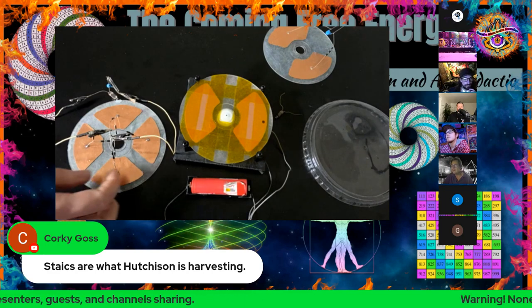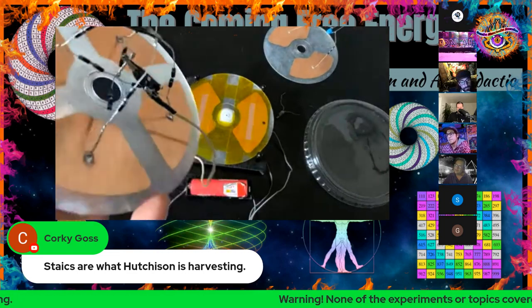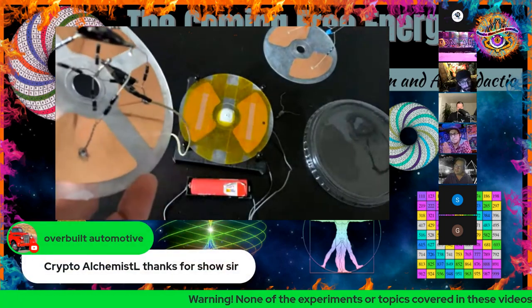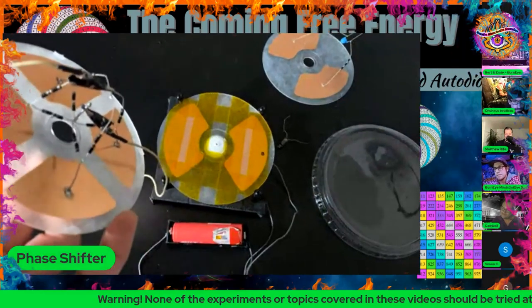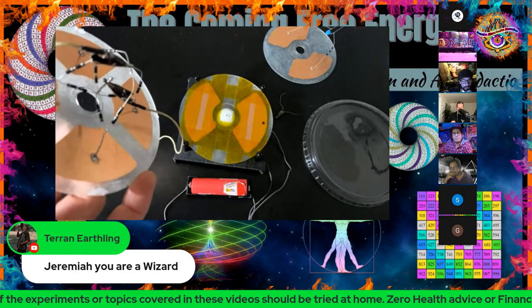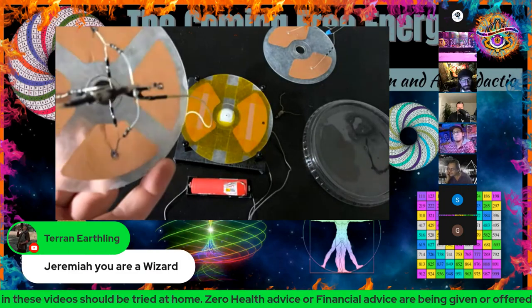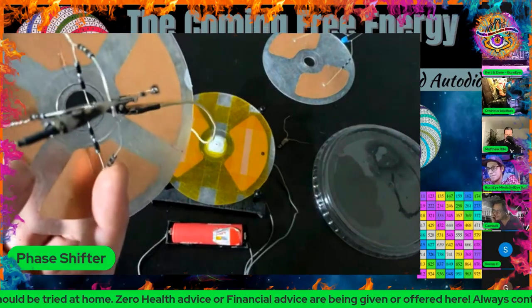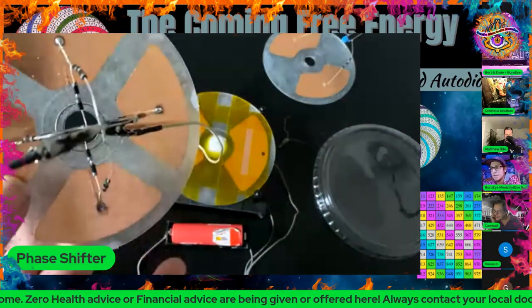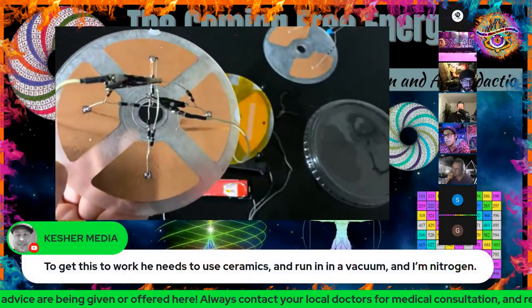And this particular one is nice because it's only got a diameter of like 2.8 millimeters and a length of about 8 millimeters. So it's a pretty compact component. And they can take a pulse power of up to about 2 amps, which makes them really, really useful. But the best part of the 2CL71 diode series is, they are some of the highest frequency, high voltage diodes that I have ever tested.